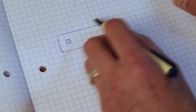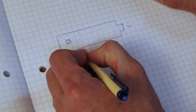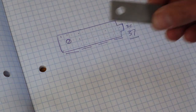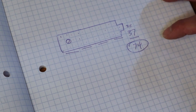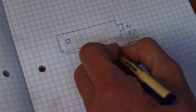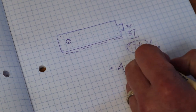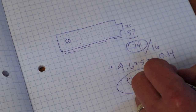Count the squares you traced. For partial squares, guesstimate — so roughly 33 plus 4 gives us 37 squares. We need to do both sides, so multiply by two: 74 squares. For my graph paper, 16 squares equals one square inch, so divide 74 by 16 — that equals 4.625 square inches. When plating, it's suggested you use 0.14 amps per square inch, so multiply 4.625 by 0.14. That equals 0.65 amps — that's what we're going to shoot for.